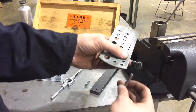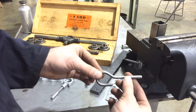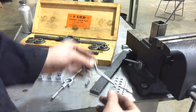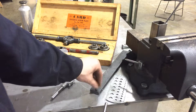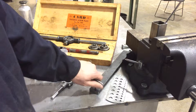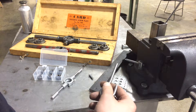The first thing we're going to want to do is determine the diameter of our bar stock. I've got a quarter inch piece of bar stock with a little hook that I bent up on the Hossfeld bender, and I want to thread it so I can thread it onto another part. I have a hole that I tapped with a tap and tap wrench in an earlier video, and we're going to try to achieve the quarter-20 thread to fit that hole.